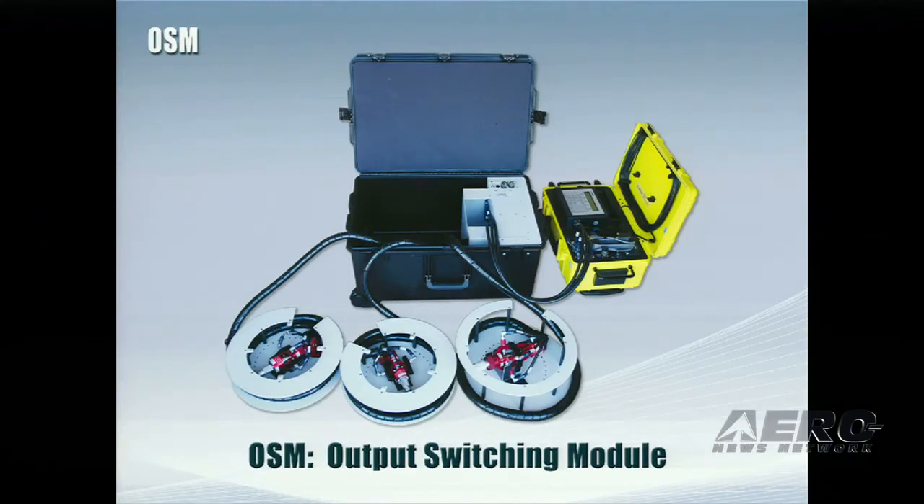As you can well imagine, it's going to be a tangled web of hoses running between the tester and the aircraft. What the OSM helps you do is make life easier for you. You can connect directly to the aircraft with the adapters that already have the hoses connected to them, and this combination of hoses and adapter are wound onto the reels that you see here. You simply unwind the hoses and adapter from the reels, slide them onto the probes, and you don't have any other connections to make — so you've minimized the possibility of leaks.